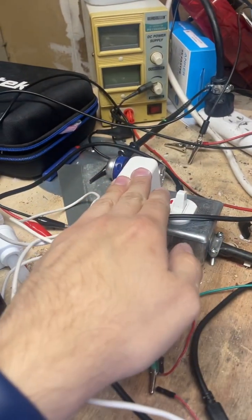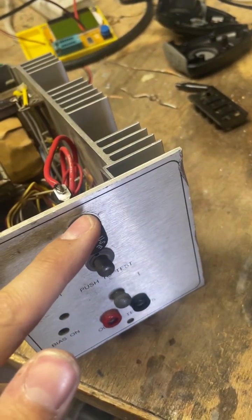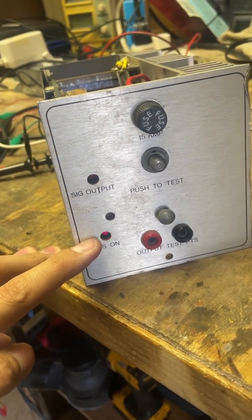I'm using a 24 volt wall adapter here — you could use two 12 volt batteries. Just make sure you use the fuse; that is important in case you connect it backwards or you short something. I'm going to go ahead and turn on the power. The device signal might turn on with some noise because of the soft start or whatever circuitry.